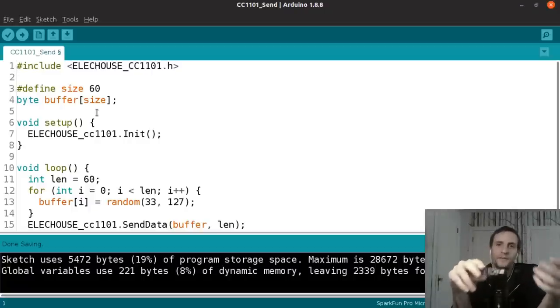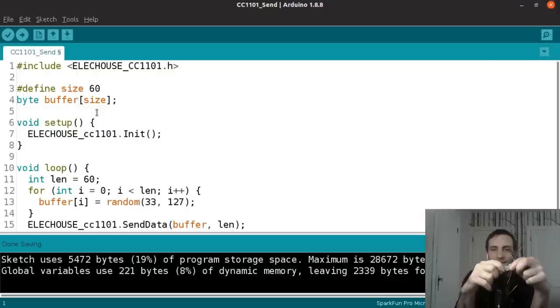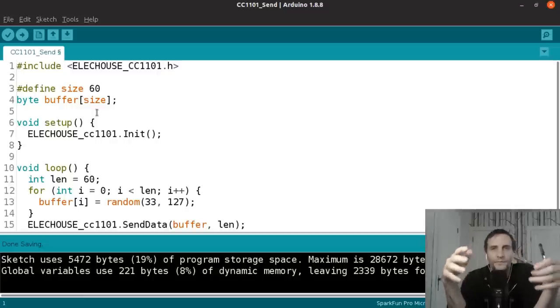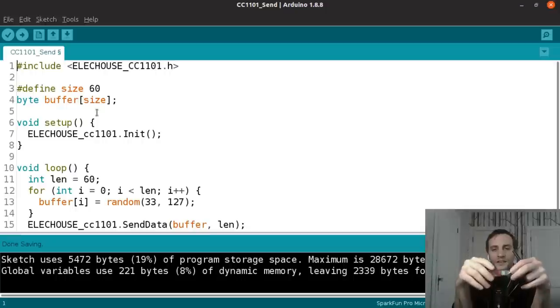And I've tested these a little bit already around the house. It seems like I can get about twice the range that I can get from my home Wi-Fi router. Now obviously these don't communicate with my Wi-Fi router because they're on a different frequency, but they communicate with each other at about twice the range of my Wi-Fi. I think the reason that they have such good range is because they're a lower frequency. So these are 433 megahertz, whereas Wi-Fi and Bluetooth operate in the 2.4 or 5 gigahertz range.